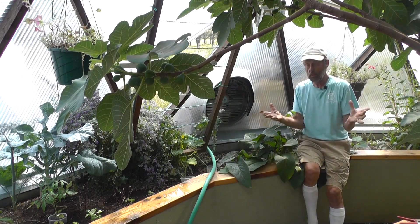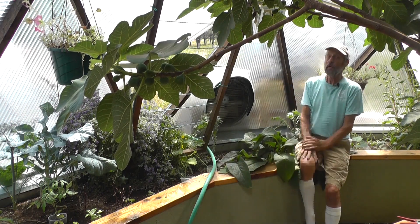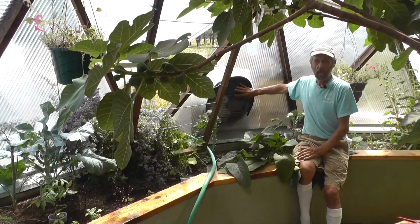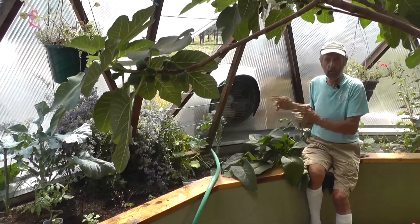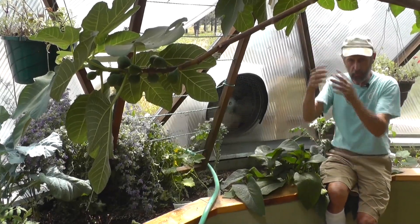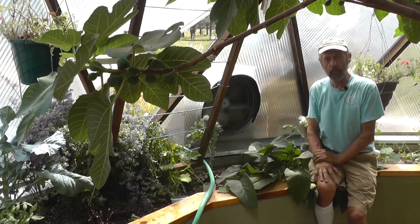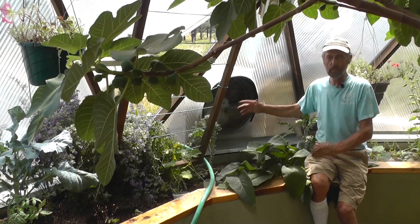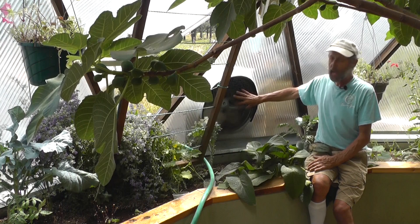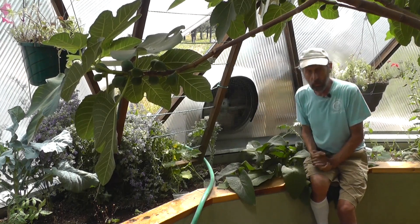The final way to keep your greenhouse cool is to use the power of moisture — evaporating water creates a cooling effect of up to 20 degrees. One way to do this is with a swamp cooler, and we've actually got a solar-powered swamp cooler. It blows air through a cooling pad kept moist by water trickling down or being pumped up through it. This fan is driven by a solar panel, with a little pump that pushes water through the cooling pad on the outside. The air coming out is probably 20 degrees cooler than the ambient temperature of 90 degrees.